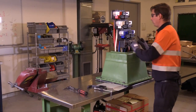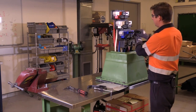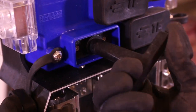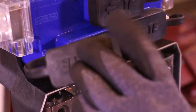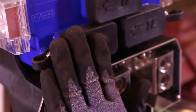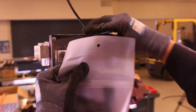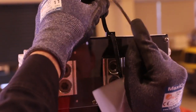The links can now be withdrawn and put in their bag for later use. The operation of the link is exactly the same as all prior-style tappet links: insert a key, turn anti-clockwise, and remove the link. Zip-tie the bag through the available lug at the top of the unit, which is a new addition that keeps all the links dry.